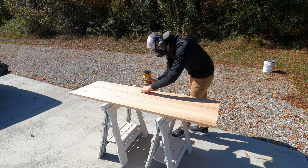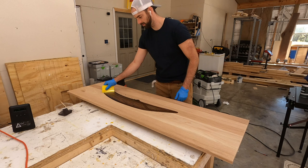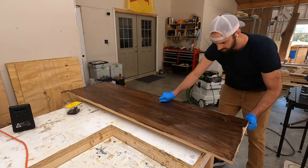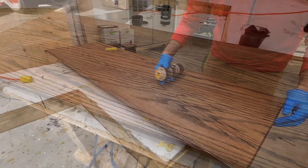Speaking of the top, all I had to do now was finish it. It was first flush cut on each end with the track saw, and then I used a roundover bit on the top to give it a more detailed edge. The router was followed by some sanding, and then once smooth I finished the piece with Rubio Monocoat Chocolate. Rubio Monocoat has become my go-to for finishing really nice pieces — it's expensive but incredibly easy to work with and gives a flawless finish, unlike polyurethane which requires multiple coats with sanding in between.